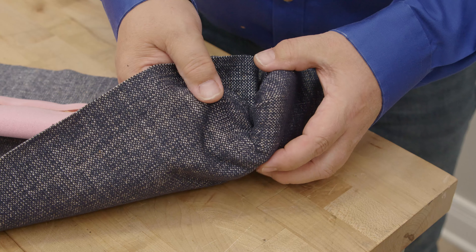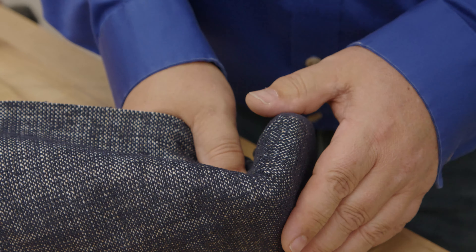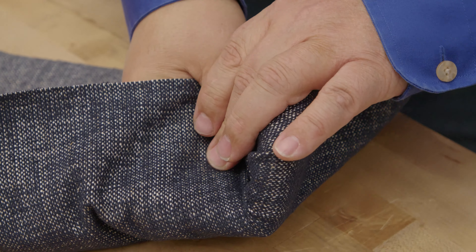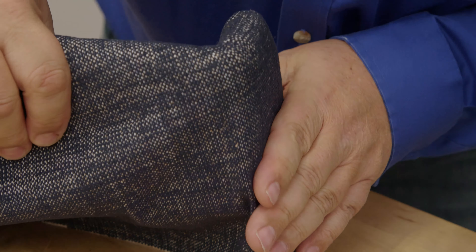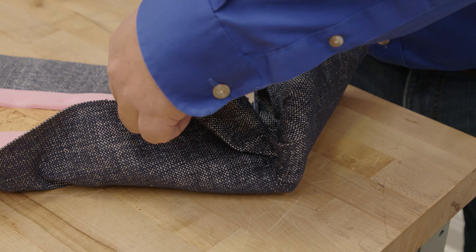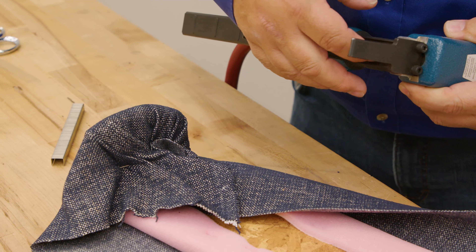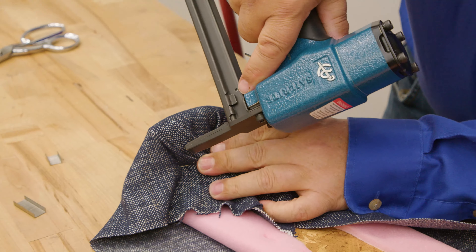I'm going to put a staple there, then lift it up and make sure this is pulled tight. I've got a little bit of a wrinkle at the corner — there's a lot of transition here — so I'm going to try to pull it out and manipulate the fold to make it right at the corner. That looks pretty good, so I'll hold tight and put a staple right here. We have a lot of bulk and we don't need all that, so I'm going to cut some of it out. I'm going to switch from the quarter-inch leg staple to the three-eighths inch leg staple so my staple will go in much deeper.